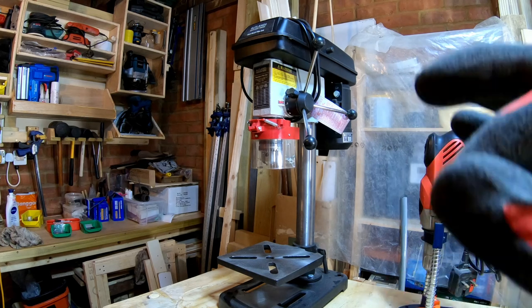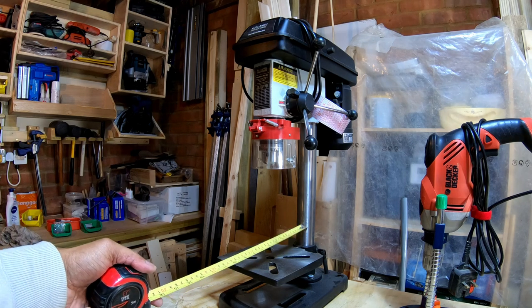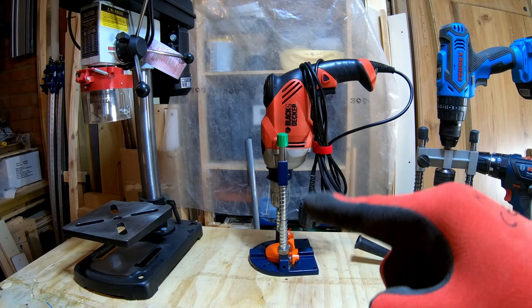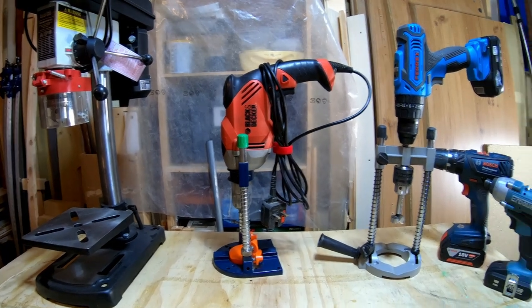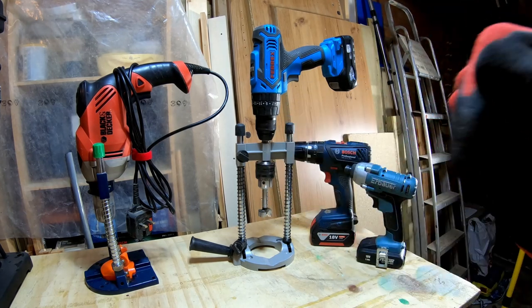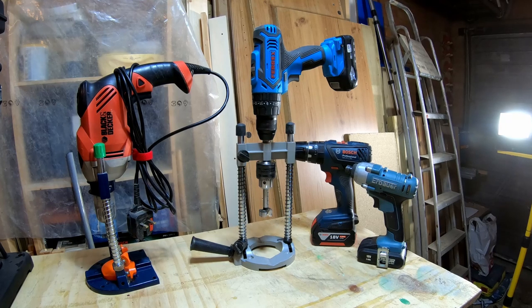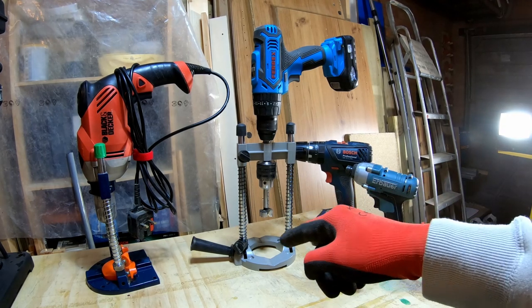As final conclusions: the drill press is 100% accurate, but in my case the depth is only about 12cm from the neck, so anything over that I can't use it. The older mobile drill stand is again very accurate, but the drawback is you can only use corded drills. The new one's advantage is you can use any of your cordless drills, plus you have the tilt base for angled drilling at 40, 45, or 60 degrees — which is why I'd recommend it. The only issue is if the stand feels a bit wobbly, you may need to pack it with washers as I showed earlier.